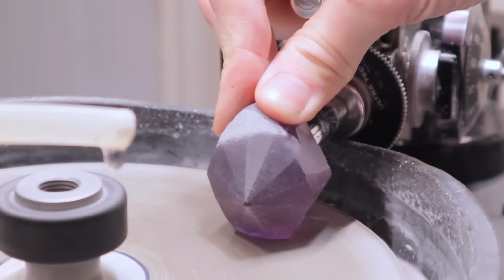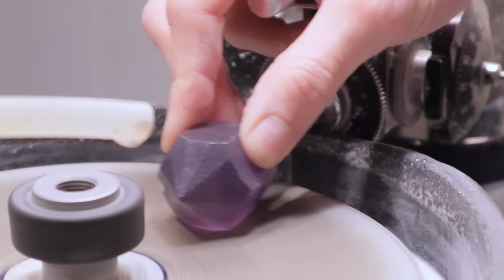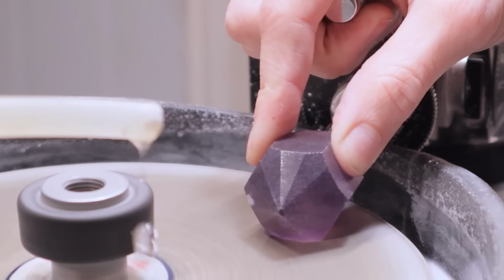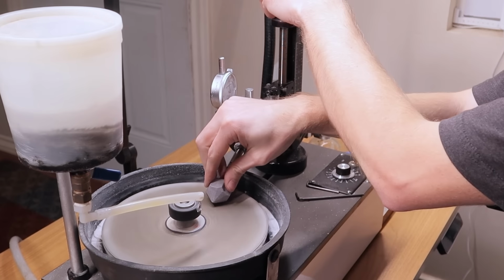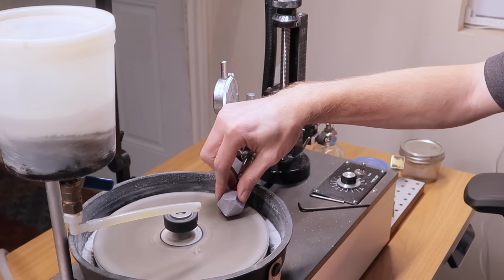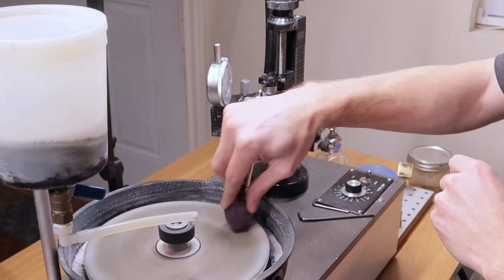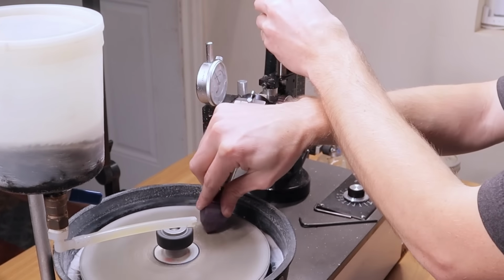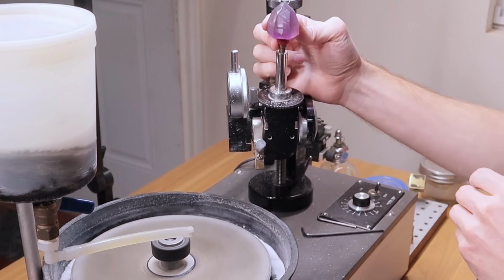This grit is really rough on the stone, so when sizing the stone there needs to be enough material left to be cut away, working through the finer grits to remove any subsurface or other damage left by the heavier grit. If a stone is small enough, it is good to just skip using any rougher grits. I start with a 600 grit when I can on smaller stones, or do a light preform on stones that can use it, not going heavier than a 180 grit.